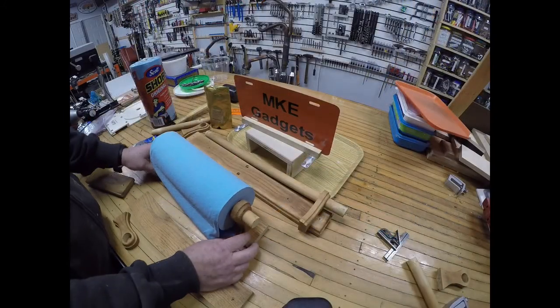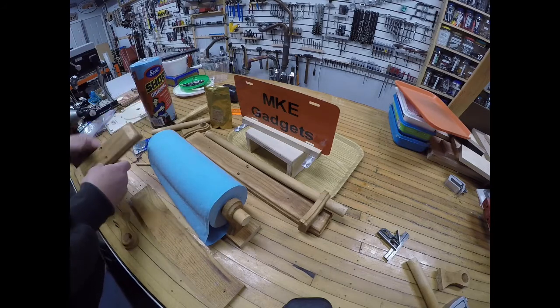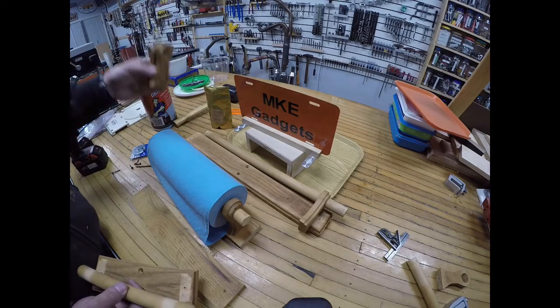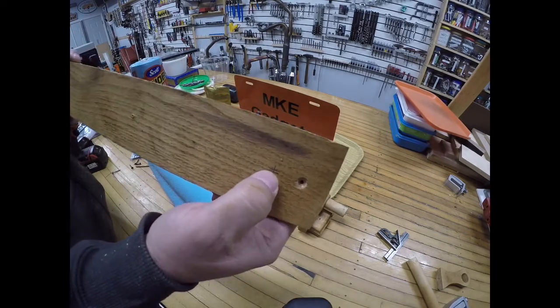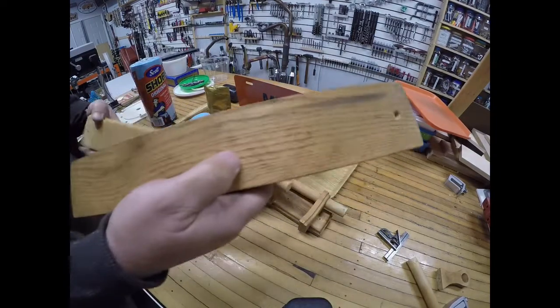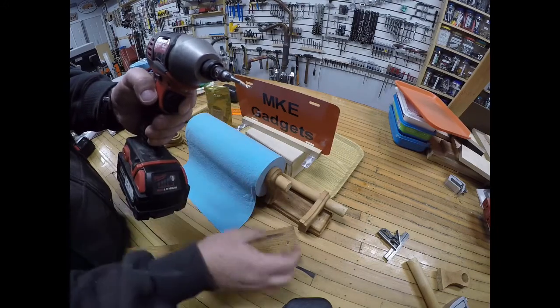Back at the bench, I laid out and centered the rack on the piece I just cut in half. The shorter piece that was a toilet paper rack is not going to be used — I'll set that aside for some future project, along with the bar from the paper towel rack. What I really wanted was the end plates. With six end plates I can make three racks. I found the center top to bottom, made two little marks, and I'll drill and countersink in the center of that line, equally spaced from both edges. I'm going to use a bit that has a drill and a countersink, so I will countersink for the heads all in one operation.